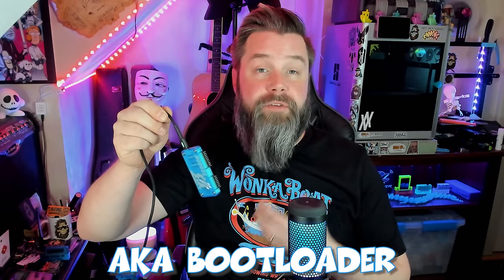All right, so here we have the official Wi-Fi board. You'll notice there's two buttons. One's boot and one's reset. It's actually written on the board itself. We're gonna hold the boot button. We're holding the boot button. And then we're gonna plug in our USB-C right there. Boom, and that's it. Let go of the boot button. And then this is in what's called DFU mode, which allows the firmware to be flashed. Let's go back to desktop and do that.